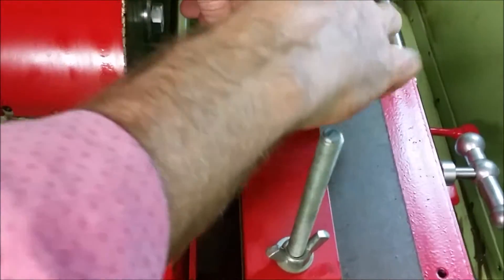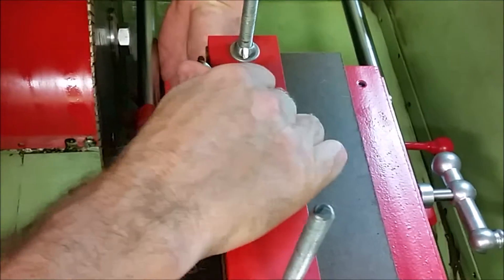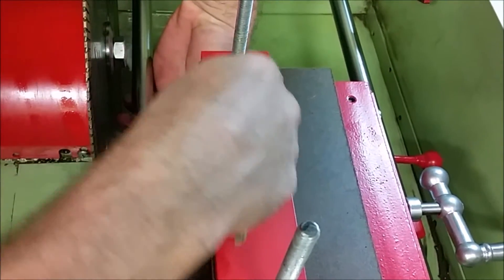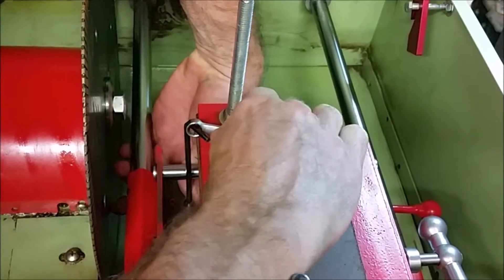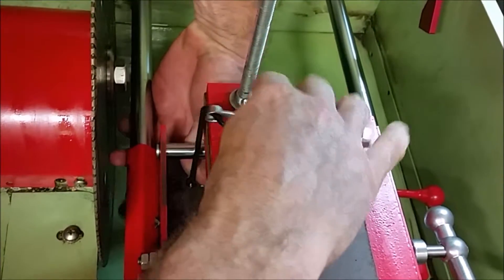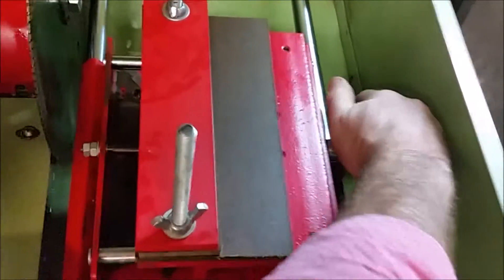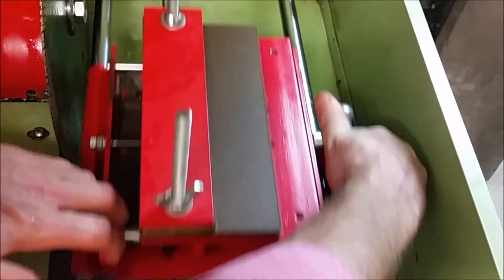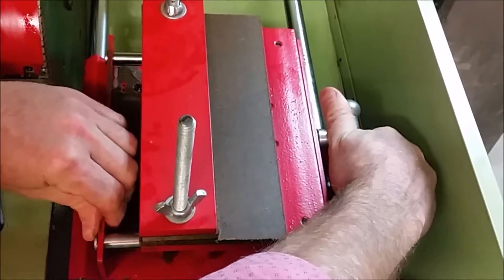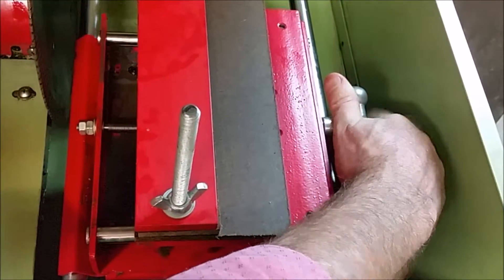I like to get to where I'm touching, and then I can back it off a little bit, so I can feel underneath when the roller's spinning freely with my finger — that means it's not touching the rail. As I tighten this up, I get it to where I'm contacting the rail. Now I'll release my feed and see whether it's too tight or anything. And with that simple adjustment, all my slop is gone.